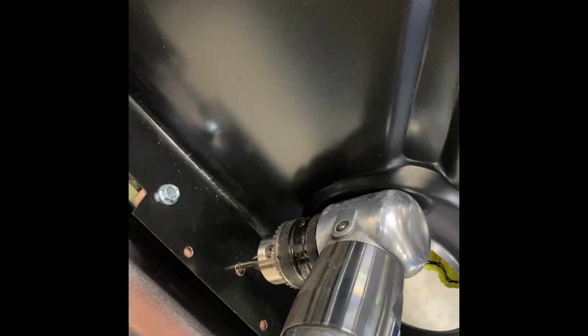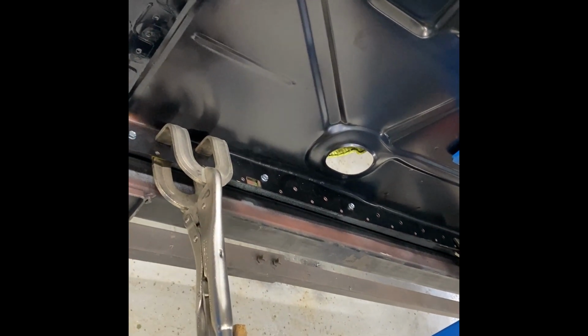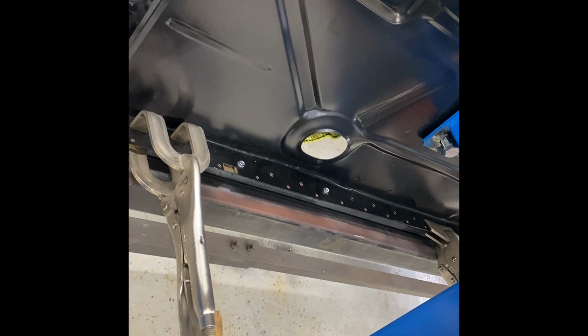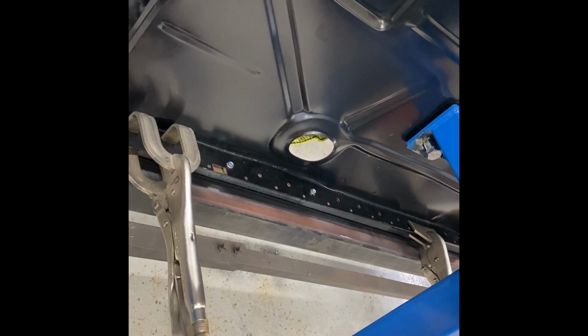And it scrapes off the weld-through primer a little bit right there. Every once in a while I get one of those, what I call impurity volcanoes, where when you're doing a plug weld, a little bubble oozes up through it. And that comes from impurities, so it could be paint, could be rust, could be anything.